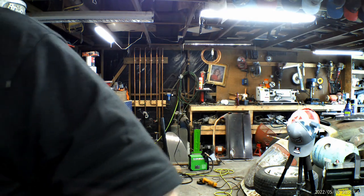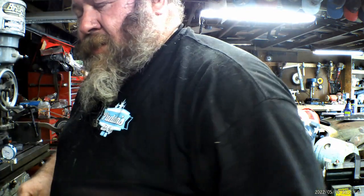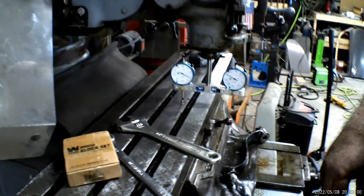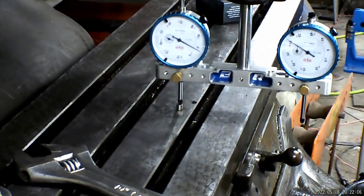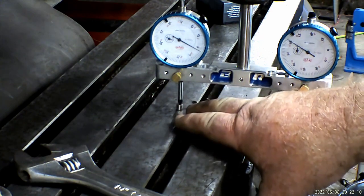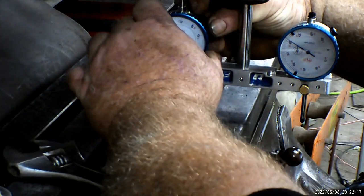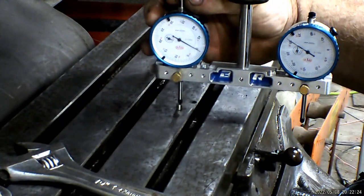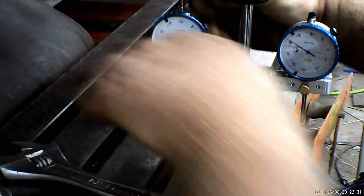This stone is going to go in the tool cabinet down here with the micrometers and gauges — seems like a good place. So I went ahead and set up the tramming kit. This kit comes with a little magnet, and that's your reference point on your mill table where you're going to set your zero. You'll want to bump your gauge a couple of times to make sure it doesn't move.